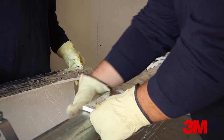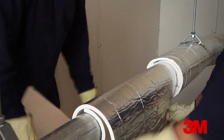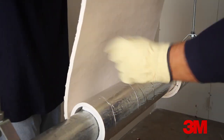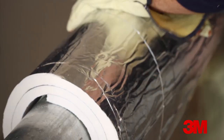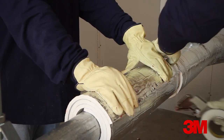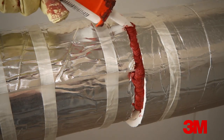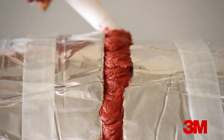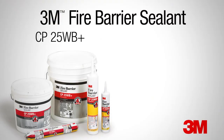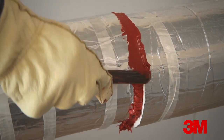With a full-width piece of EMAT cut to the length determined by the previous measurement, the piece is anchored to the conduit using filament tape and then wrapped around and attached to itself with filament tape. When the continuous wrap method is used, the gap between the adjacent sections must be filled with 3M fire barrier sealant, either CP25WB+ or FB3000WT, to the full depth of the EMAT. Tool the sealant into place, cover with aluminum foil tape, and press down the tape.